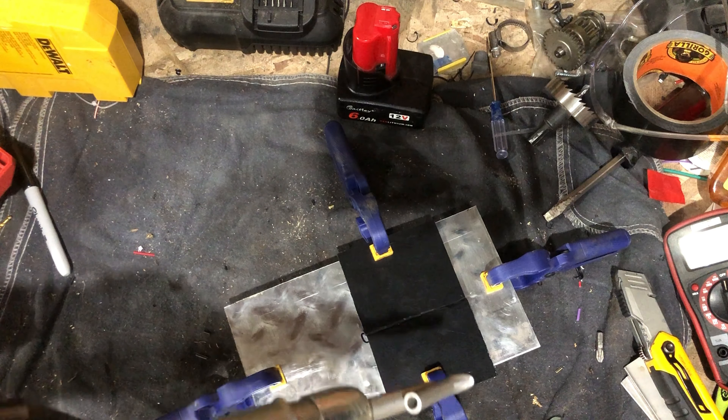So the gun's cooling down in the background — that's what that noise is. I'm still learning how to do this myself. I think I hung out just a little too long right there, but you can see once I got going it laid the bead down in there pretty good. It's pretty stout — I'm having to apply a lot of force to break it. As you can see as I bend it, toward this end the actual plastic is trying to bend before the weld bends, which is what you want for a good weld. I got a big project coming up where I'm going to be needing to weld a bunch of plastic sheets together, and that was the tool I got to do the job.